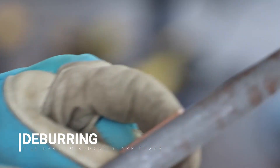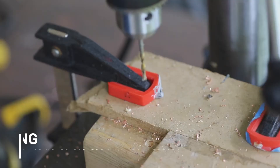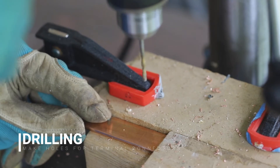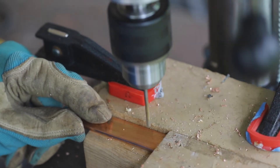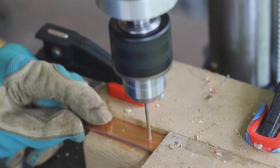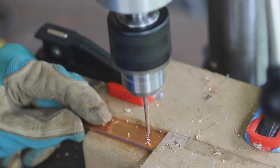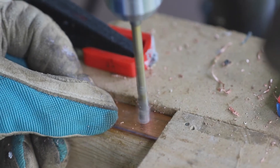Once the bars have cooled down, we finish them with a file to knock off any rough edges. With each bar cut to size, the next step is to drill holes on each side. We use these holes to bolt the bars to the cell terminals. Similar to our use of the saw, the friction from the drill bits can heat the bars quickly. When drilling these large holes in the copper, it helps to start with a small bit and gradually work up to the ideal hole dimension.